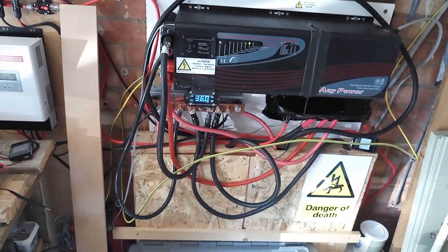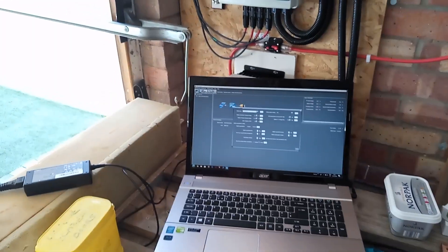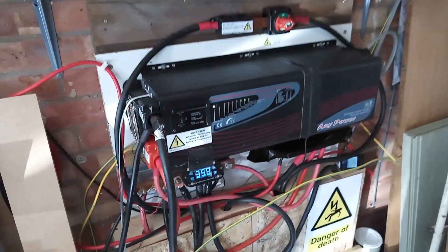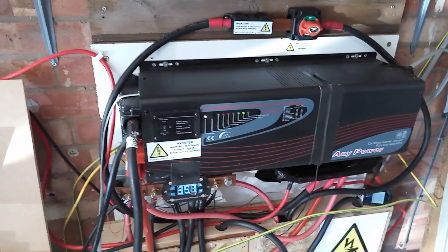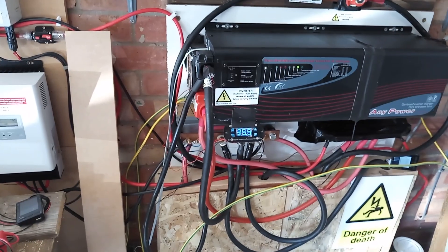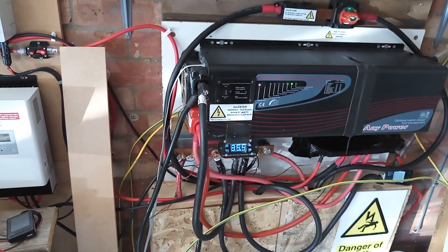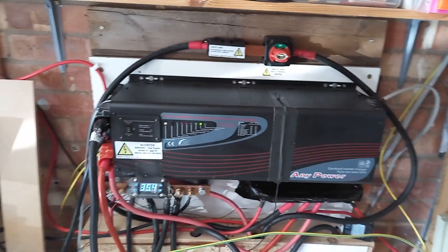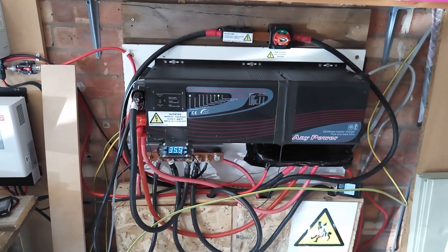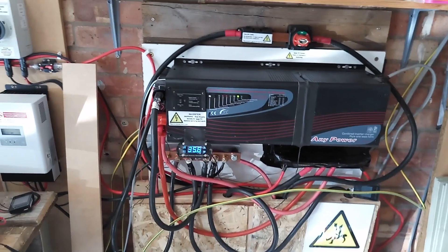This is just a test at the moment to see how the cells are performing, which is a great feeling — being able to go down to 18 or 19 volts if necessary. My inverter here, which I might upgrade, cuts off at 20 volts — well, it's got two settings actually: one's 21 volts and the other one's 20 volts. I need to do a bit more research to see if I can get the supplier — not from China, they're pretty good anyway — to get the cutoff voltages programmable, or at least get them to send me one set at 18 volts.